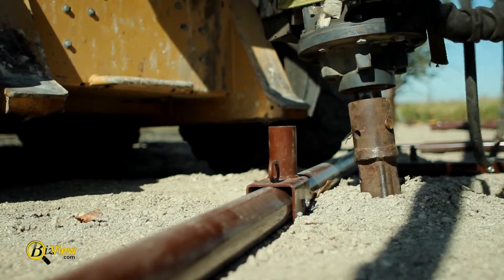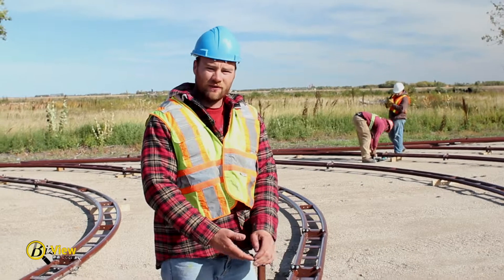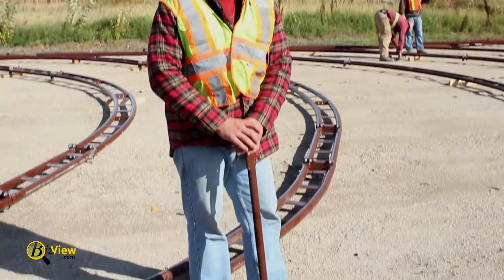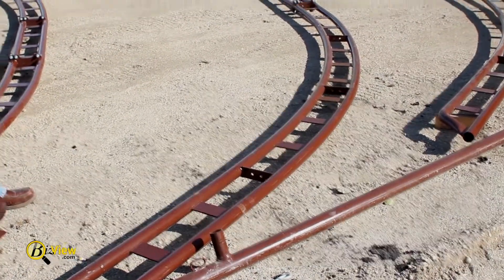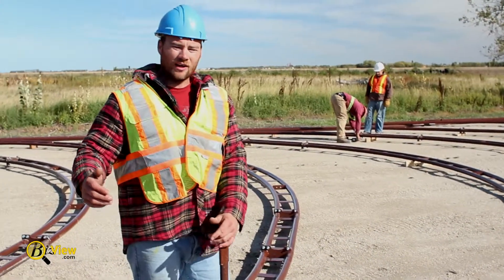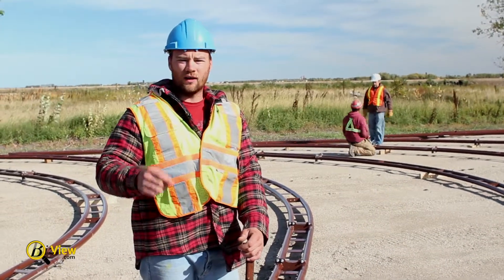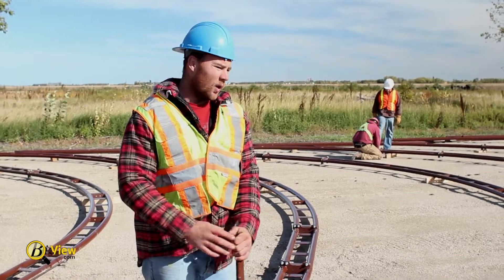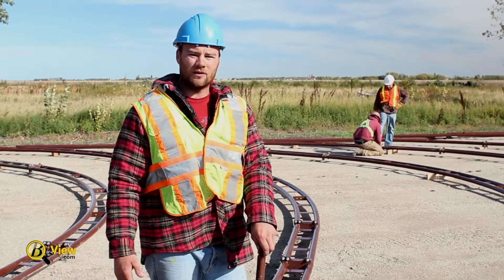It's fairly easy when you have the equipment to do it. If you're not able to use our factory-supplied anchors, there are many other options for fastening down our buildings, such as concrete blocks, a ballast system. We've even had people out in Ontario dig down to bedrock, hilti into the bedrock and use chains up to the rafters. So if you think the anchors aren't going to work for you, we'll make it work for your situation.